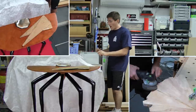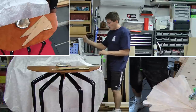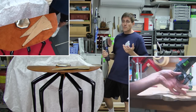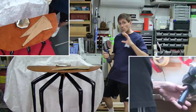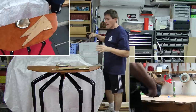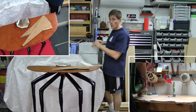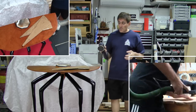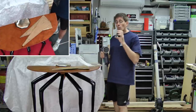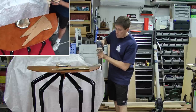I did the hydration trick every time I did a significant amount of shaping. Then we moved on to one of my favorite shaping tools — the RAS. It's fun to play with, especially for shaping rather than just stripping. If you intend on doing shaping with the RAS, I'd recommend P36 and P50 — maybe a little 80, but 36 and 50 will get you a long way. Next up was the RO90, used for grits above 50 and some 80, starting work in and around 80. The small sander makes it easier to get into tight radii in the transitions, and using the interface pad makes it a lot easier for the sander to go over the variances.